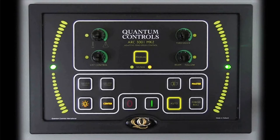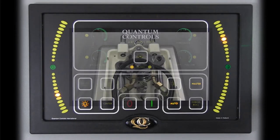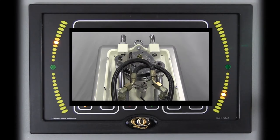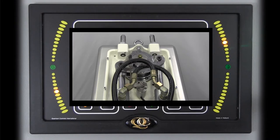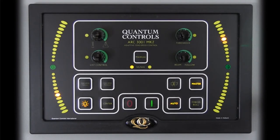So long as the vessel is underway, the two underway modes — auto and manual — are available. To engage the stabilizers in auto, simply press the auto button. In auto mode, the control reads the roll position and velocity from the roll sensor and, together with recent roll history, determines the optimal fin activity to reduce vessel roll. Fin activity will be evident by the fin position LED indicators. For most situations, auto mode will yield the best performance and presents the least burden for the operator.